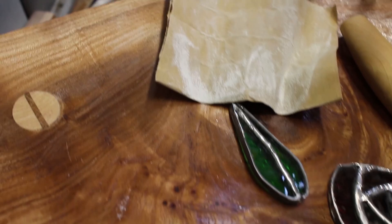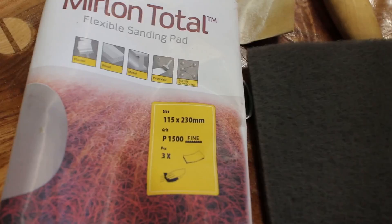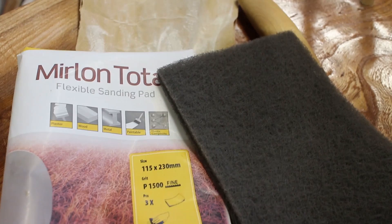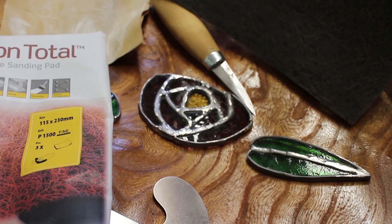Anyway I'll carry on doing all of this and then in the next film I'll actually show the finished chair, which would be great. This is the plastic wool that I use — it's just enough to take the top surface of the varnish off, because I think the worst thing about varnish is if it looks like varnish. So carefully prepared, and it sounds ridiculous when I say about six layers, but if you sand between the coats you're actually taking off quite a lot, so you're doing a very thin finished layer — it's just a gentle build up, but it should come up quite well. Anyway, hope you enjoy seeing the progress, and as I say next film we'll have the finished chair. Thanks for watching.